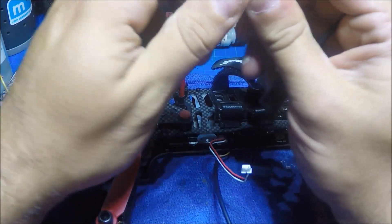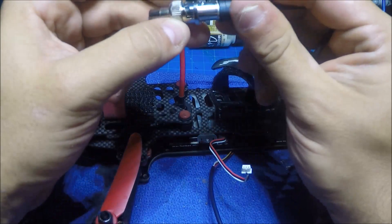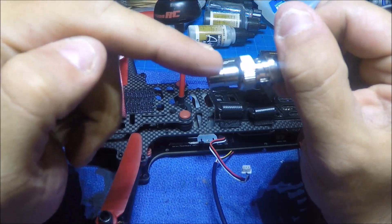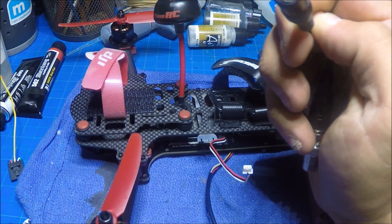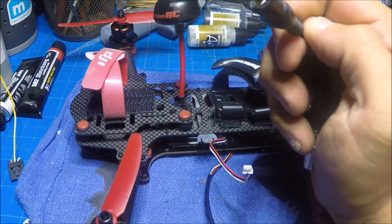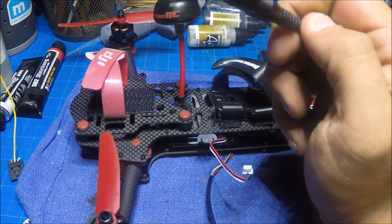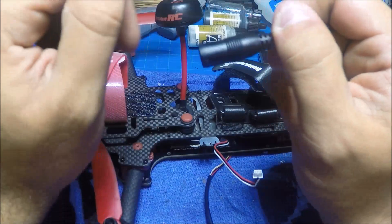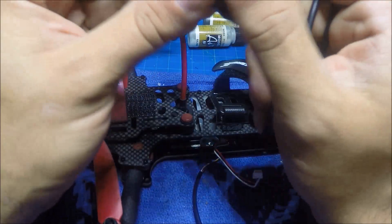The OSD cable is basically going to come just like this. You're going to need a BNC-to-RCA adapter which clicks on there, then a regular RCA cable to go from there to your monitor, and then a center-positive power supply — anything from 5 to 20 volts, so a 3S battery works. If you've got a ground station set up you basically just need a BNC adapter. I had them because I'm running a DVR that uses them, so it worked out perfectly.